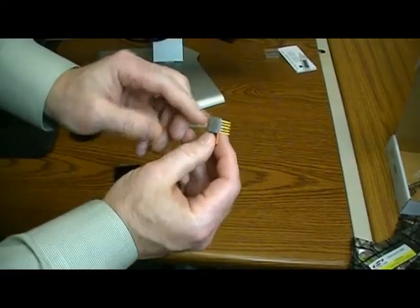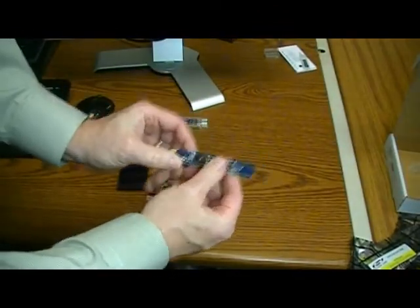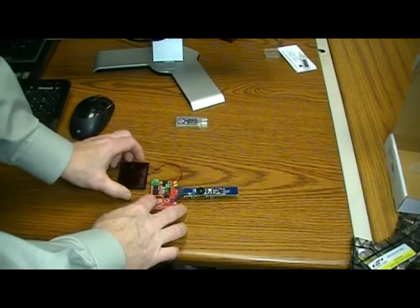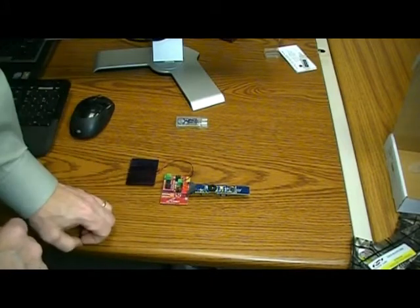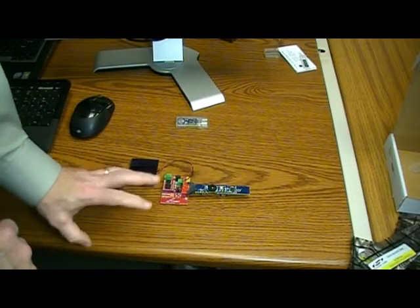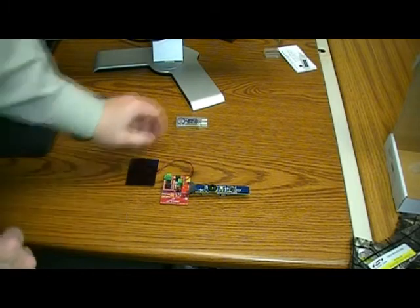You'll notice there's a connector that I'm going to place on the EVAL-10, and you can see this edge card connector plugs into the Silicon Labs device. I connect it like that, and you can see now that the Silicon Labs RF to USB stick is powered from the EVAL-10. It's as simple as that — they're all connected up and now you have an energy harvesting setup for the Silicon Labs card.